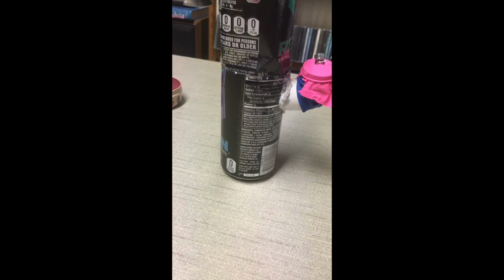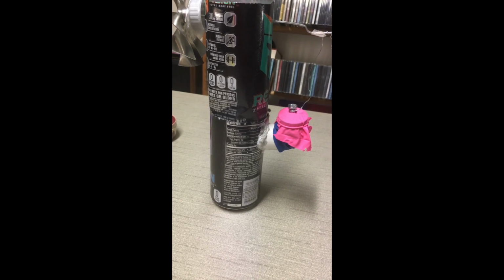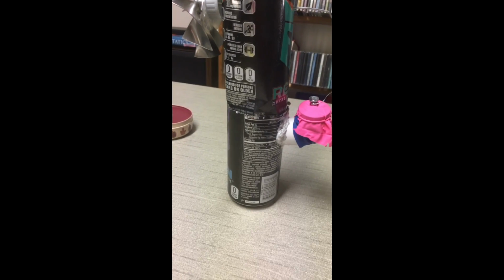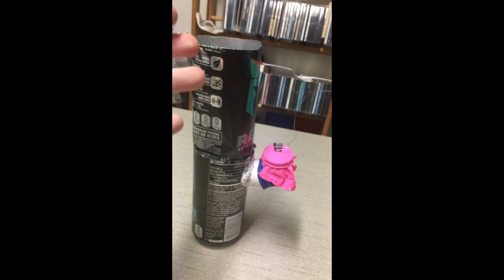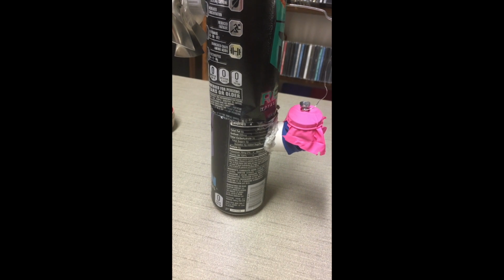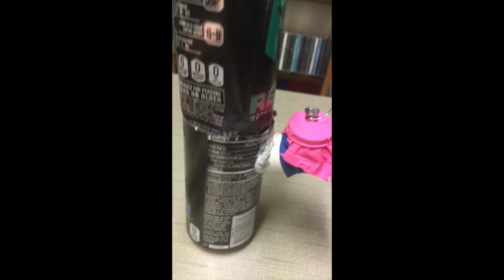So for the future, I would probably use something thicker than an aluminum can. I don't know, maybe a steel can, 2 or 3 steel cans or something like that, so that it would be thicker, so that when you're messing around making the holes, things like that, maybe have it be 2 cylinders instead of having to take cans and make them into cylinders to begin with. That might be helpful. And then, yeah, there's got to be a better way to connect the displacer up to the crankshaft, because there's just so much internal friction and there's so much air loss here.